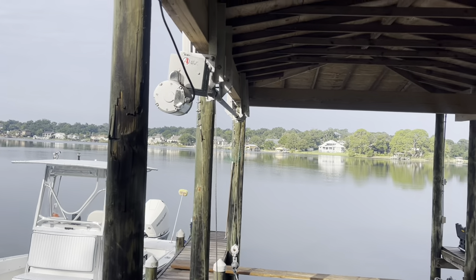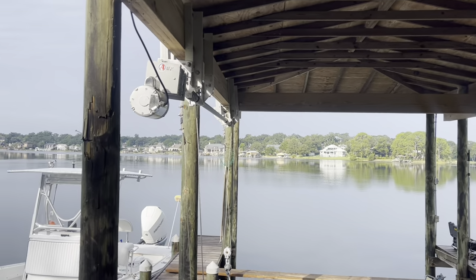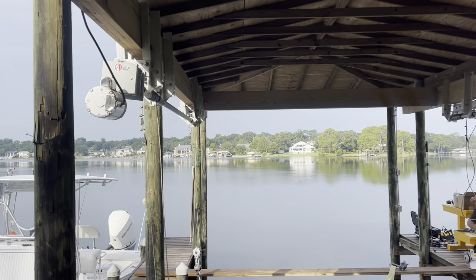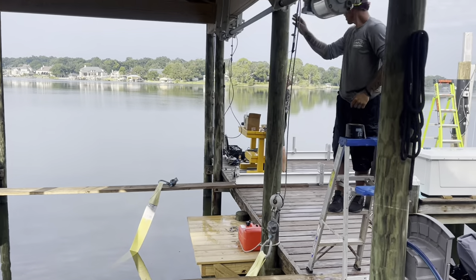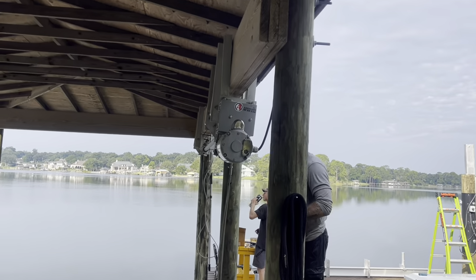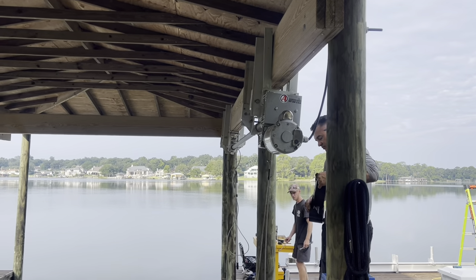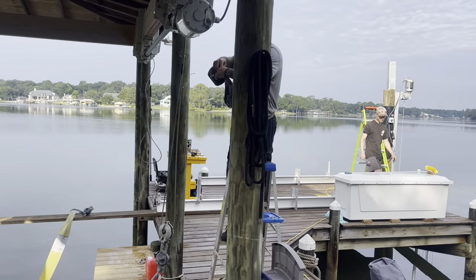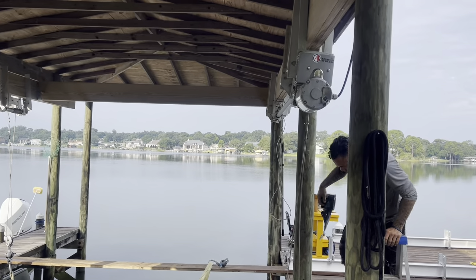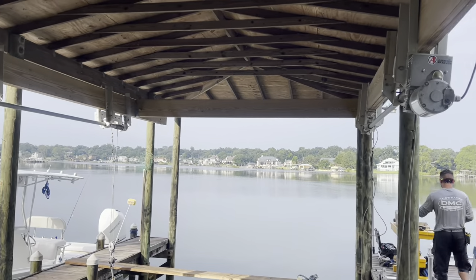Here's a boat lift we're doing some repair on. We've got a boathouse hanging lift in here, which is really designed to hang straight down, not to pull in with straps on it. You can see there are straps on it, and this is a fairly wide boathouse. It's actually twisted this 2x12 and twisted the metal on this pipe, causing it to bow in, which really concerns me. So we're going back with a cradle system to give it a direct pull straight up and down, as opposed to pulling in at a little bit of an angle causing that stuff to bow in.